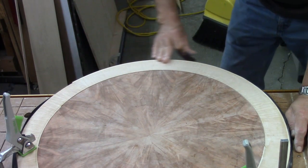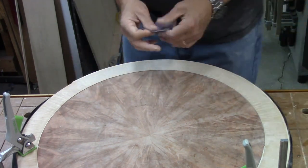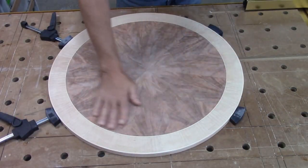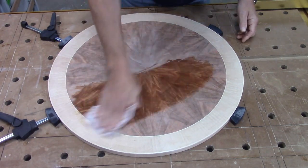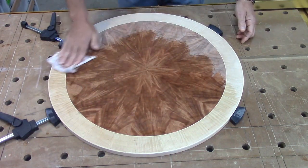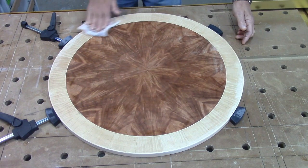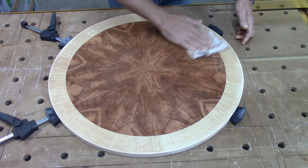Now I've got the edging on and it's reasonably flat to the top and the sides. I can go ahead and put the last piece on and then put the rest of the stringing inlay in between the field and the border. I've got all the edging and inlay leveled down and sanded to 320. I wet it down with some naphtha to get a better look at how it will look with a finish. I'm pretty happy with it overall. There are some things I'd do differently the second time — this is the first time I've ever done this, so I made some mistakes. But I think I recovered from them pretty well, and overall I'm very happy with it.